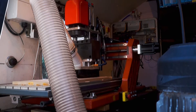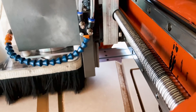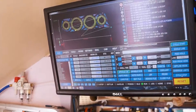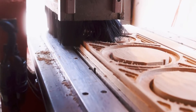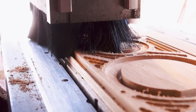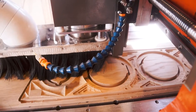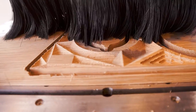You can see the different kinds of paths it takes — when it's just doing a cut-out it's doing a basic X/Y movement, and when it's bobbing up and down that's when it's doing the contoured slanted edges or more detailed parts. Just like that, one section of parts is ready to go. Here's a quick whip pan of the electronic setup — it's all custom PCBs that tell the CNC where to go. On the job you can see we're doing a number of different passes: starting with a standard flute cutter for the basic shape, then going in with a bullnose cutter — a three-mil one — for the final passes, finishing with a crosshatch which makes it slightly easier to sand.